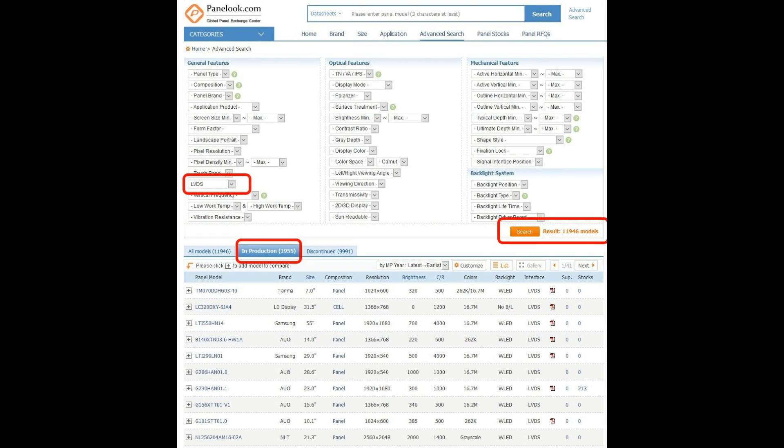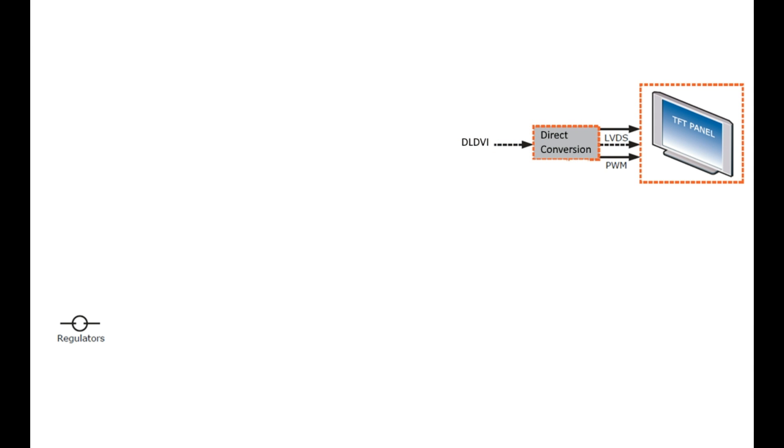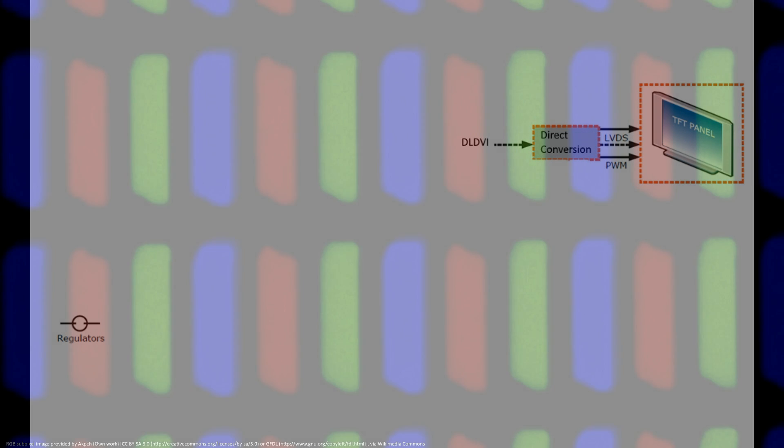How can this board be used? With most LCD panels on the market, most TVs and monitors use LVDS internally to send video data to the panel. By using this board, you eliminate all other electronics between your computer and panel, eliminating display latency, unwanted features such as interpolated frames or color reconfiguration, and enabling display overclocking.